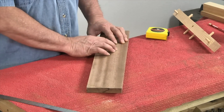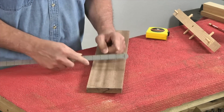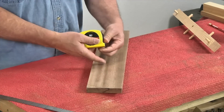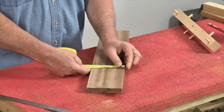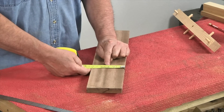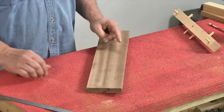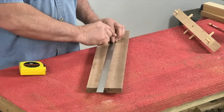There are lots of ways of finding a board center line. You can simply measure it and do a little good old-fashioned math, or you can buy a dedicated center point tape measure like this one. Take the reading on the top scale and it shows you the center line on the bottom scale. But with each of these, you have to mark the center point in a couple of spots first, then use a straight edge to mark the center line.